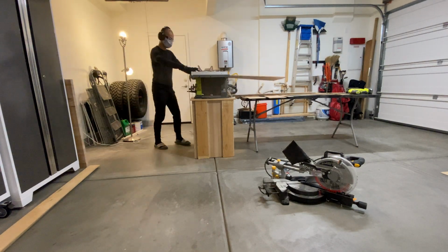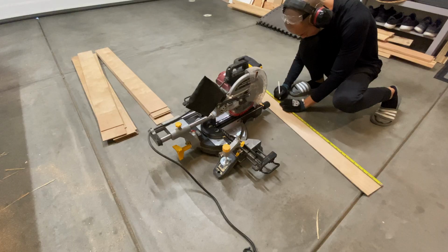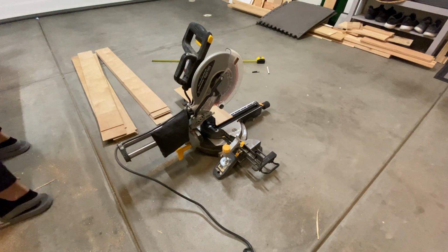I used the same 4x8 underlayment plywood that I used for shiplap in my other videos, and I'll put the link in the description. I ripped them into 4.5-inch wide planks with my table saw, cut them to size, and nailed them in.